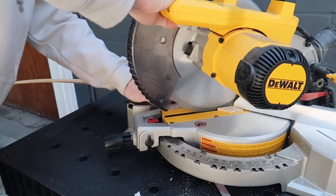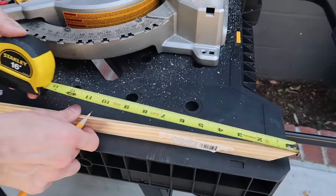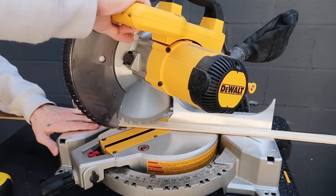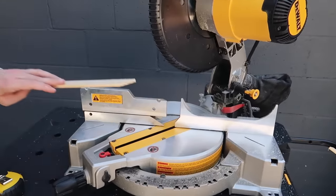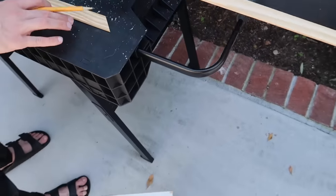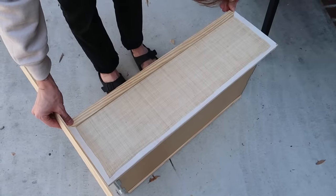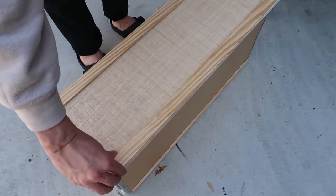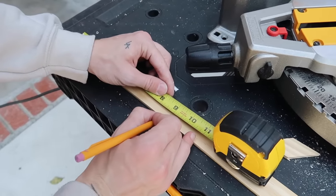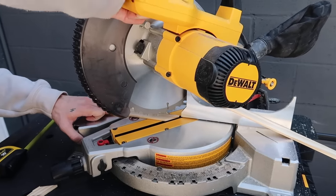The trim on the drawers was actually the scariest part for me. I had never done any form of angled cuts before, but I used my miter saw and set it to 45 degrees. All you have to do to create these cuts perfectly is create your first angled cut at 45 degrees on your piece of wood, then measure out the length of your drawer — mine happened to be 29 and a half inches. I measured that out and ensured the angles pointed into the middle to frame off the outside of the drawer. Once you have one trim piece cut perfectly, you can literally just trace that same shape onto your next piece of trim. I do suggest cutting a little bit more than you think so you can always trim a little extra off if needed.